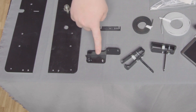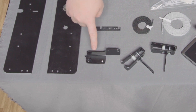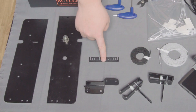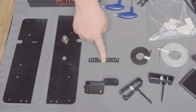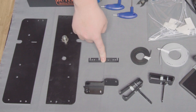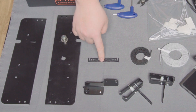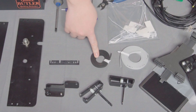This is the carriage Y bracket. This bracket connects directly onto the Moxie quilting machine. With this bracket, the robot can pull the machine forward and push it backward. This is the quick release for the carriage Y bracket. This part allows us to quickly engage and disengage from the machine the belt that controls the forward and backward motion.